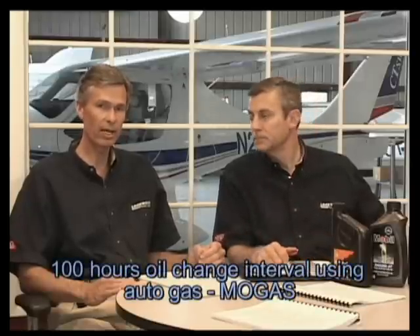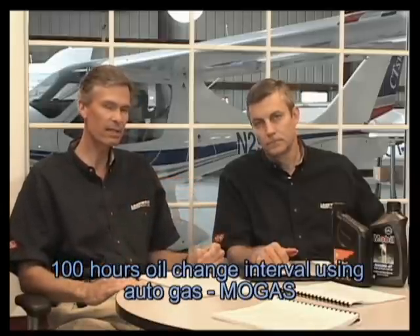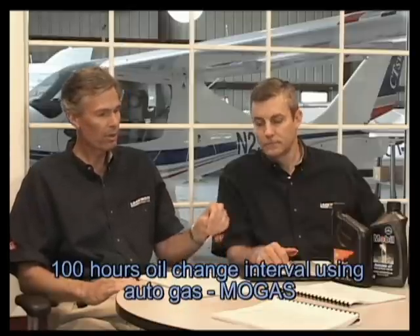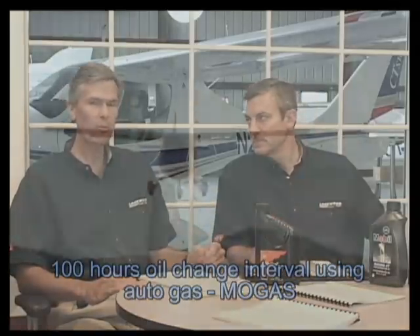It's also important to know when you should be worried about using full synthetic or semi-synthetic oil, and what oil change intervals you should use. One of the advantages of the 9 Series engine is that because of its tight tolerances and modern automobile oil and metal technology, you can go 100 hours between oil change intervals. We have a lot of experience at 100 hours — even running at 5500 RPM continuous, it'll go 100 hours if you're using unleaded autogas, provided oil temperatures are within the acceptable range Rotax recommends: between 190 and 230 degrees would be ideal.